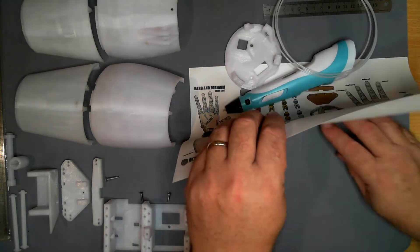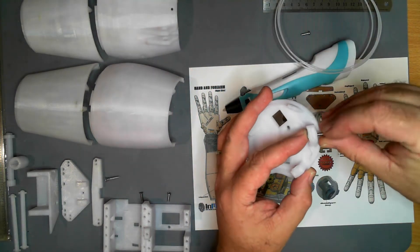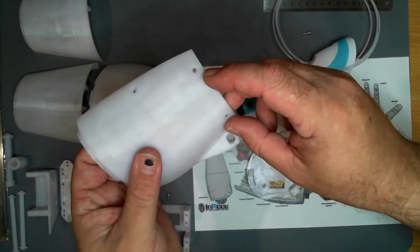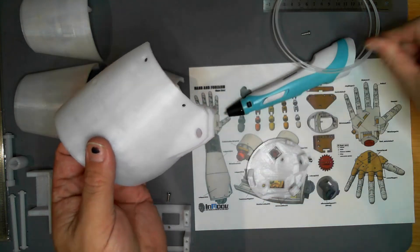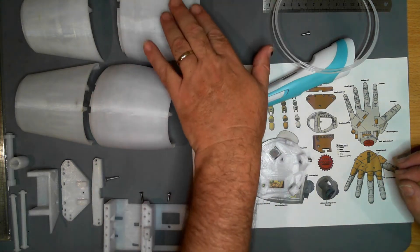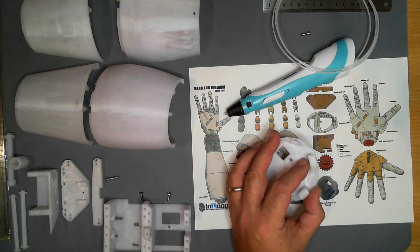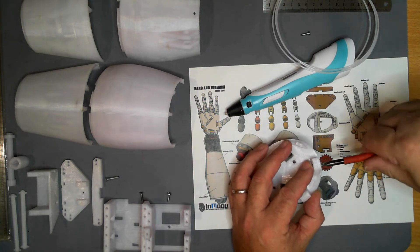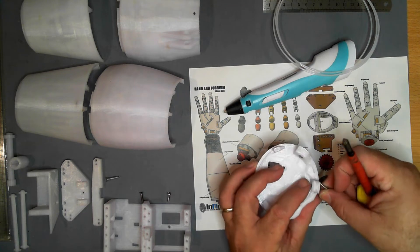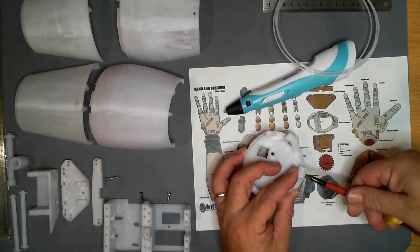Apart from that, it's supposed to work exactly the same. I've got the screws here, so I'm just going to put these screws in — they go through the holes here. If you have a close look at these, you'll note that they are designed for a countersunk head. I've noticed that Gael is fond of the countersunk or flathead screws, and they give you a nice flush surface. I don't happen to have any on hand, so I'm going to use these roundhead ones instead. To make sure we don't block the exit of our screws, I'm going to screw these in far enough that they bite in — I can hold the parts on with this — and then weld them in place.